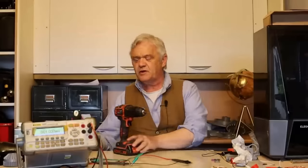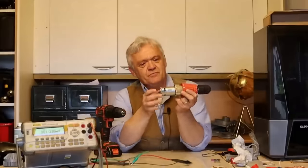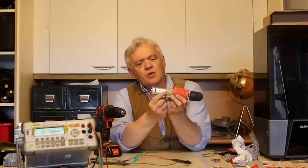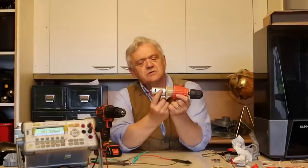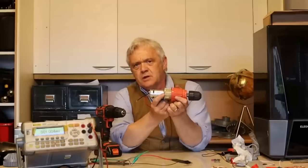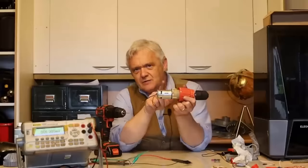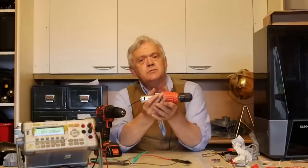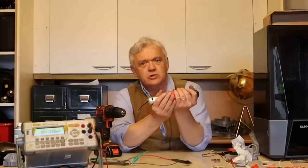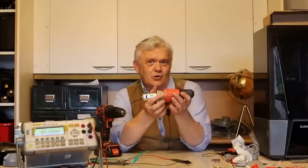This motor is absolutely everywhere. But what we're doing applies to any of this kind of motor irrespective of size. If we take it apart, this is a really popular motor — but it's quite depressing, actually. If we were to take it out of the gearbox and spin it by hand, we'd probably get about 0.2 to 0.3 of a volt out of it, because we need to gear it to get speed before we start getting voltage. And once you gear it you do get speed, but you need very much more torque to turn it — and we don't have a lot of available torque.